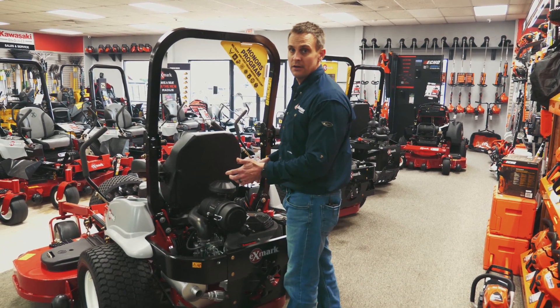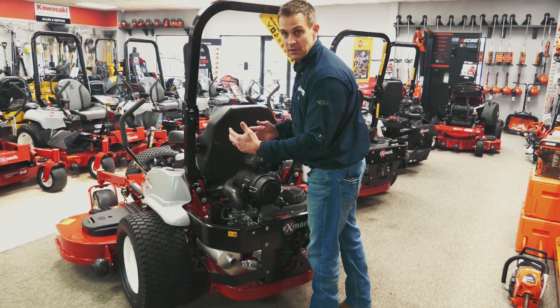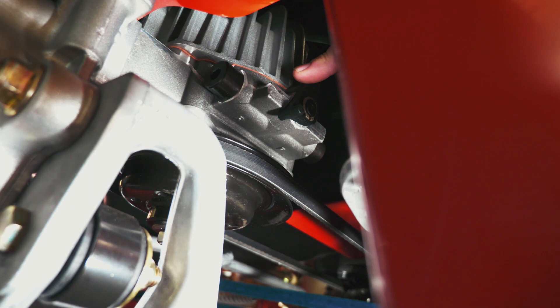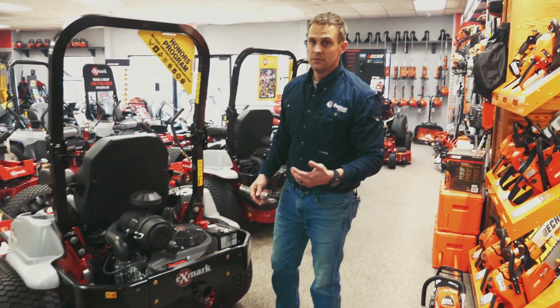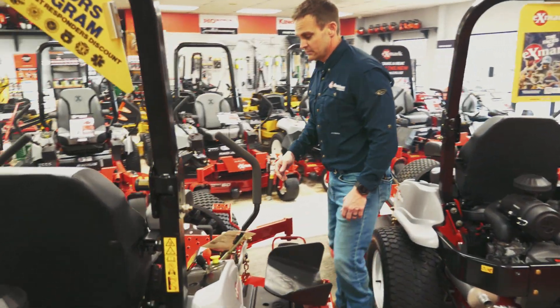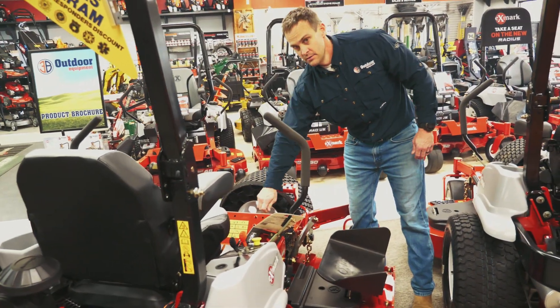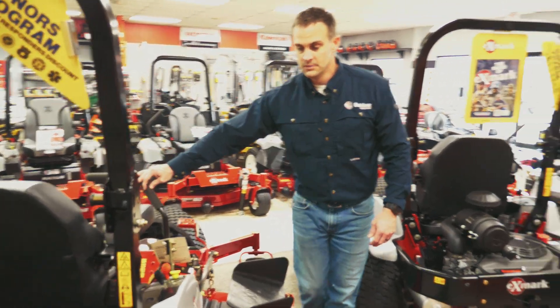You have one on the left and right-hand side of your mower — it's inside the wheels. So you flip those black plastic switches up, and then you walk to the front of the lawnmower. You always got to take your park brake off, which is up front on the right-hand side of the mower, and you pull the handle in, and then she's ready to push.